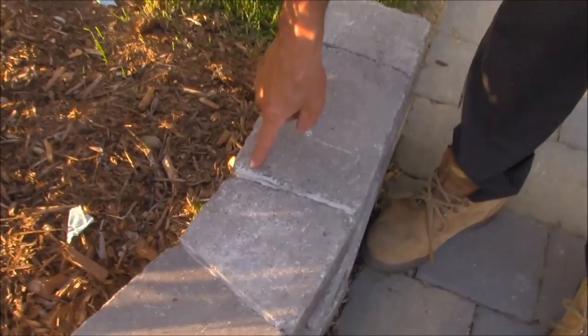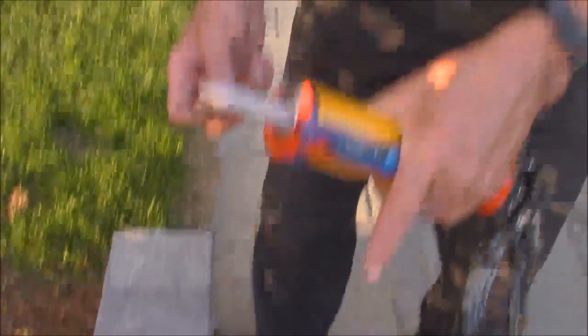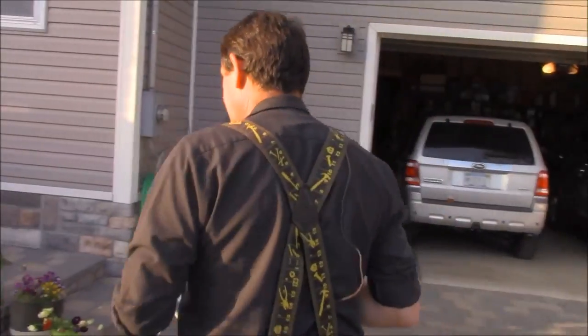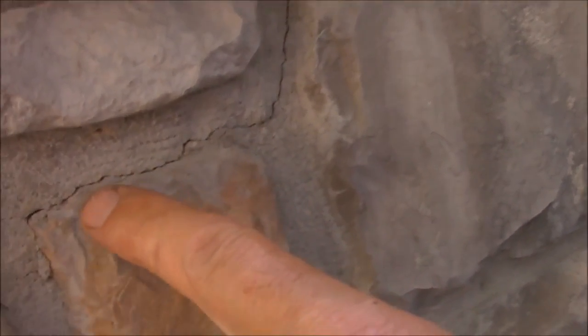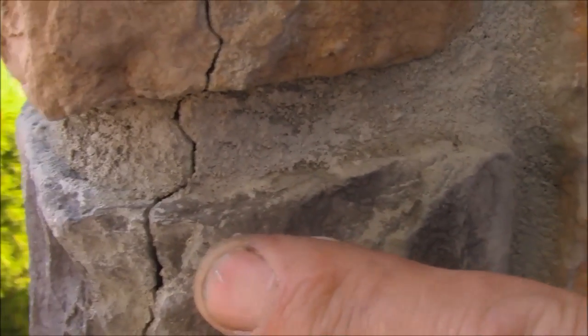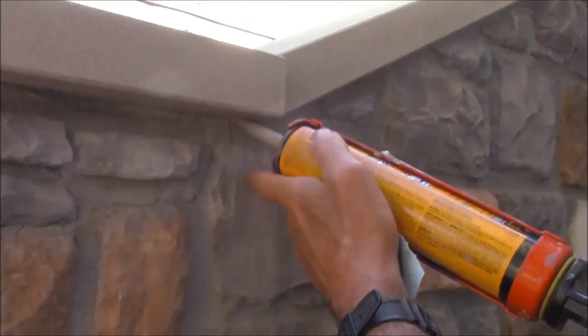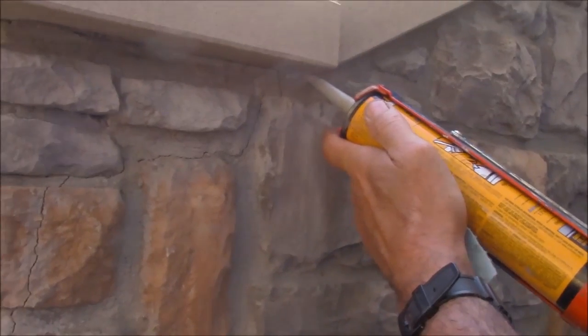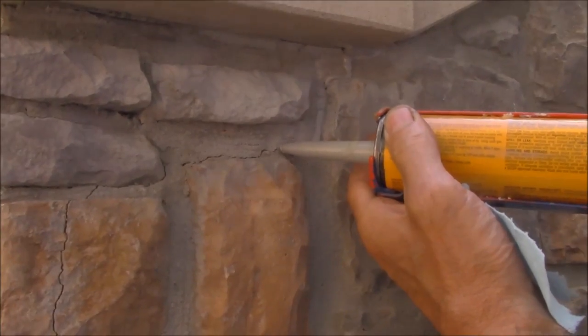Our thicker caulk is sagging a little too, but that was a huge joint we went across. We would have never made it across that joint with the self-leveling caulk. So here's a reason why I brought this home — hairline cracks in this mortar work here. Take a look and you can see where my mortar is failing. More water or expansion and contraction has gotten in here and created a void that's going to cause me some problems. So we're going to use the self-leveling caulk because I can get it to sneak in where I want it to. Patience is the key in this job.